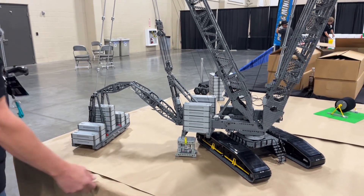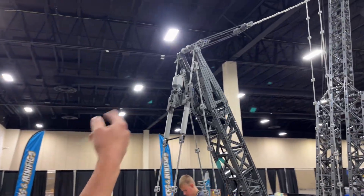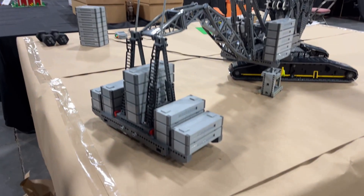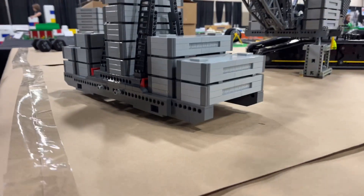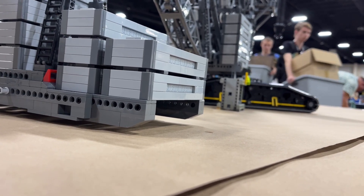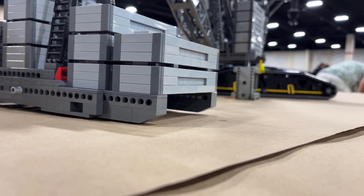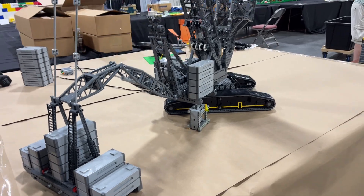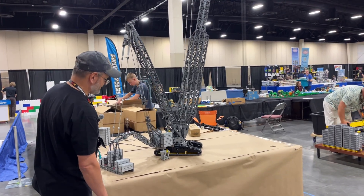It's almost on the ground. On these, you also have these up here — these are your hydraulics. Obviously that's the best I could do with the motor. But I can drop that counterweight onto the ground; I can drop the weight if I need to. As soon as I drop that, my needle on the front is going to go up because all that weight will be shifted to the front of the slew ring again. And there goes the needle. So I'm going to transfer that weight back off.